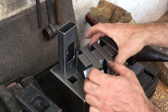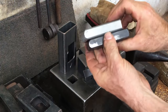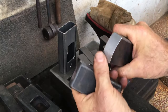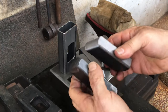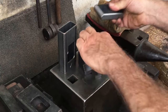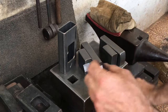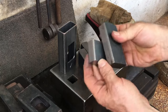On this very latest version, the dies are three-quarter inches thick by about an inch and three-quarters wide. I've also had a lot of radius machined on the striking end of these dies. The die sets I include with this are fuller, flat, and mating V die sets.